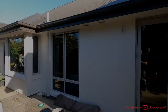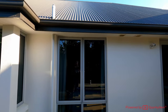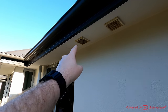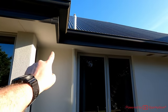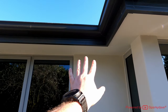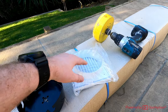There's the hole in the ceiling - relative to the shower it looks pretty damn good, and that plumbing pipe is right beside it. Looking outside, we already have two existing grills on the exterior of the house. The bathroom roughly sits about five meters from one of them. The first grill goes back to the range hood - we cannot connect a bathroom fan onto a range hood setup. The second one goes back to an existing bathroom fan and a separate toilet - this one we can definitely junction the new bathroom fan into. We wouldn't want a third external grill in the vicinity because it would look unnatural.